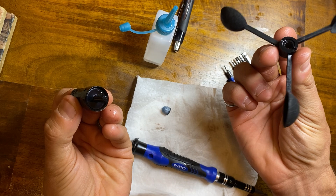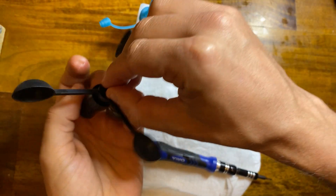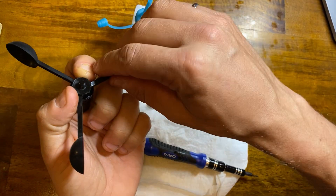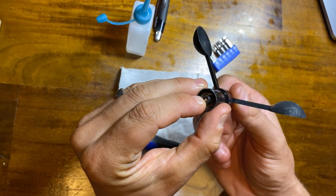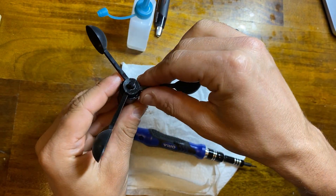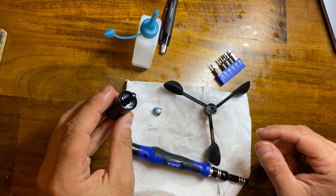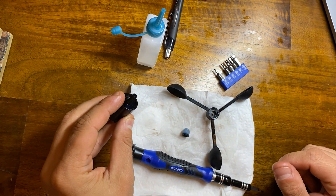When you go to put your cups back on, line up the divot — make sure you have that on there right, or else this thing won't register when you start climbing to the top of the mast. Get that on there. I can tell now when I spin the cups it's spinning the other side. It's not doing it because I didn't put the screw in all the way, but this should spin when you spin your cups. You just put on your end screw cap and you should be all set. Thanks guys.